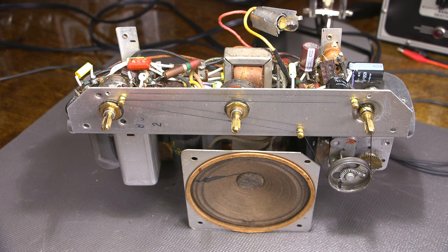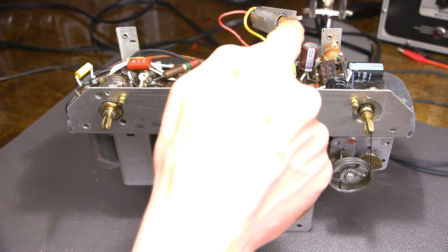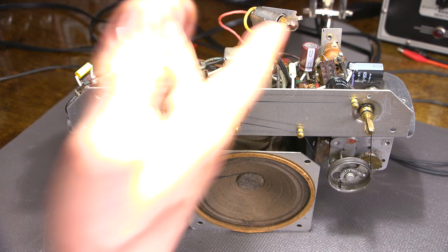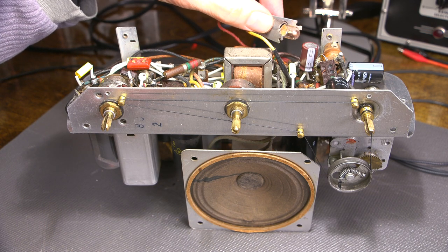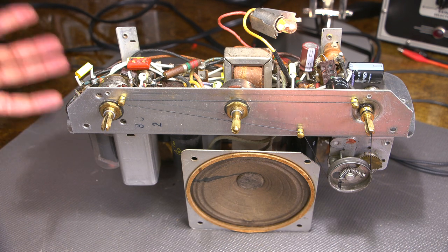All right, so I'll turn on my current-limited isolation transformer and Variac supply now. You'll see this little light flash as it comes on, which is normal for an All-American 5 radio receiver. As the vacuum tubes start to draw current, that bulb will light up indicating that the rectifier and all the other tubes have come into emission. I'll just wait here - you'll see this get just a little bit brighter. You can see it's getting brighter already - the tubes are coming into emission. It looks a lot brighter in the camera than it actually is - it's a nice golden hue to that filament, a nice warm white color.